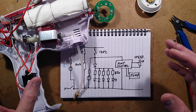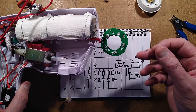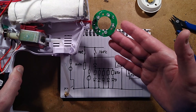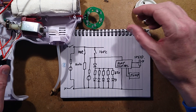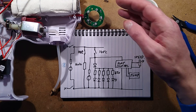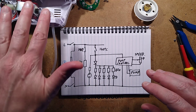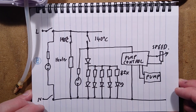This thing is very hot and it's staying hot for a long time — it's got a good high thermal mass; it is just burning to the touch. I've taken the thermal switches off, and I've taken the circuit board off the front, which is held in place by the friction of the LEDs. There's nothing really stopping it pushing back and touching the metal casing, though nothing is grounded because it is double insulated. But it's a bit of a sloppy design.